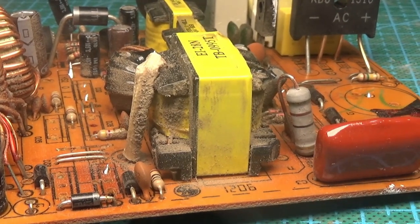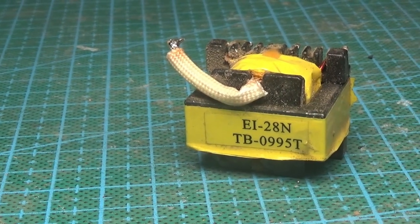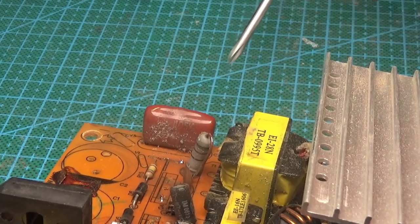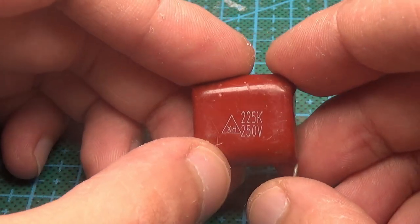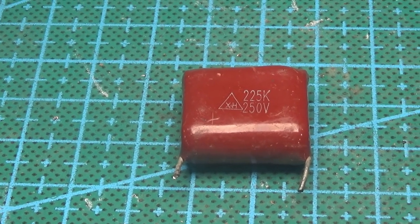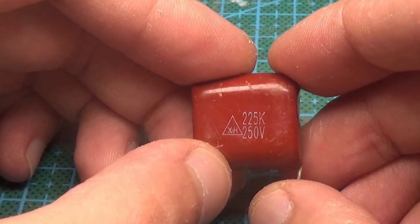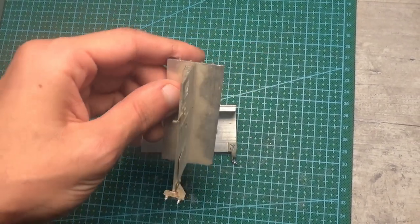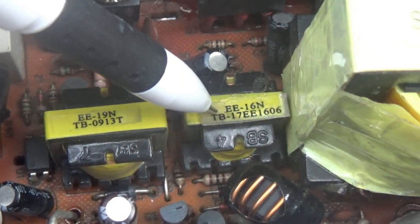Finally, we got to the power transformer and I am happy to demount it. Such a core can deliver perhaps 100W in the best case. The board again pleases us because you can install a larger transformer here. The film separating capacitor is 250V with a capacity of 1uF — let's put 400V with a capacitance of 2.2uF. It is better to use a bank of two capacitors with lower individual capacitance to evenly distribute the load and reduce total internal resistance. Replacing the transistors will certainly give a result, but their cooling is quite poor, so I throw out the original radiator and install a new one. It would not hurt to replace the matching transformer too — it's too small, but I'm not touching it yet.